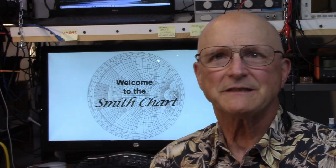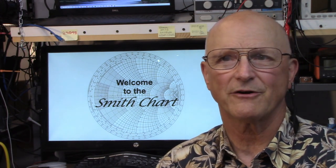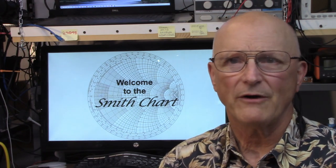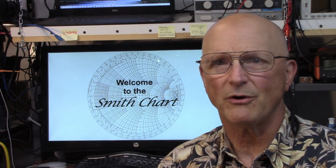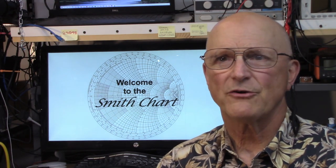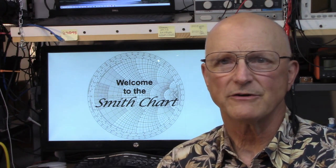Well, we have successfully designed and built a stub match to provide nearly a 1-to-1 SWR at 100 megahertz for our purposely poor load. In the next video, I will be designing and implementing a stub match to convert the impedance of a VHF folded dipole to that of my 50-ohm feed line. It will be centered around a frequency in the middle of the amateur radio 2-meter band, 146 megahertz.